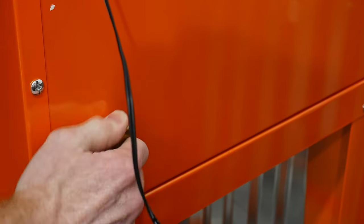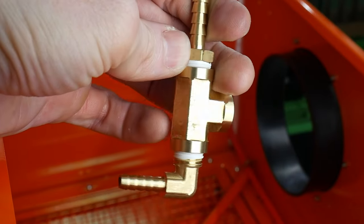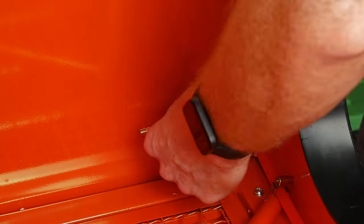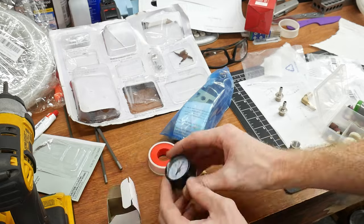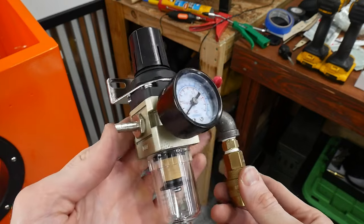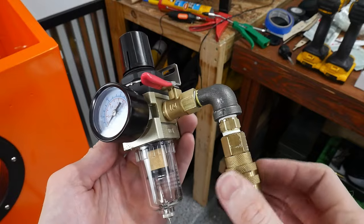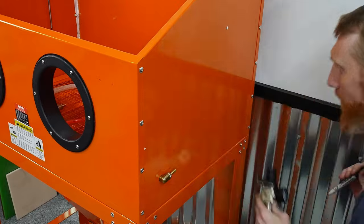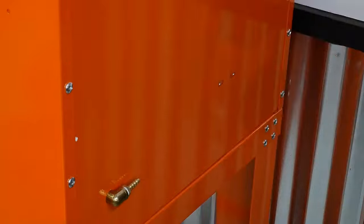I sourced most of the fittings and extra components from Amazon, and we'll put some affiliate links in the description below. An air filter regulator like the one we are installing today is a necessity for a sandblasting cabinet — not only will you be able to fine tune the pressure with the regulator, you'll also knock out the bulk of the liquids from your air compressor. Depending on the climate you live in, this can be a significant amount of fluid, which will gum up your sand if not caught.